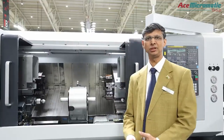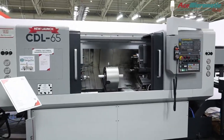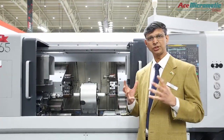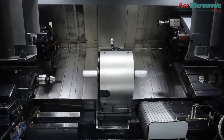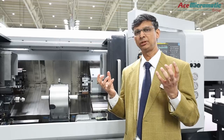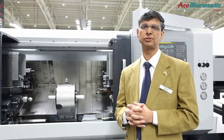This is another new launch — this machine is called the Center Drill Lathe, capacity CDL 65. The feature of this machine is that it is highly productive. It can machine on both sides of any shaft simultaneously. As the name indicates, the center drill lathe performs facing, chamfering, and centering operations. This machine is also integrated with automation for higher productivity and efficiency.